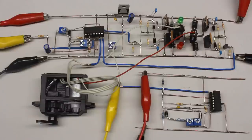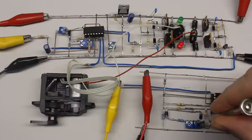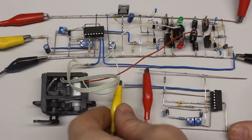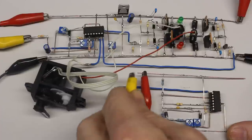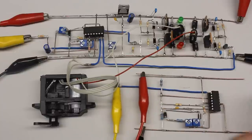The precision of the simple control circuit shown here is lower than that of commercially available servos. Furthermore, there is no protection against missing or too-long command pulses while the circuit is connected to the supply voltage. If the voltage at the control input drops to zero, the servo turns in one direction until stopped by the mechanics. If too-long pulses are applied or if the control input is connected to the positive supply terminal, the motor starts turning in the opposite direction.